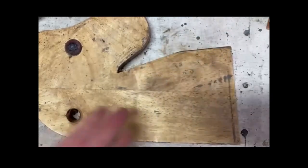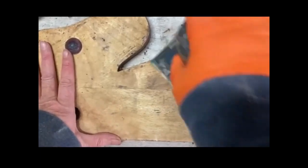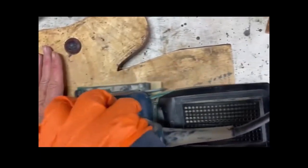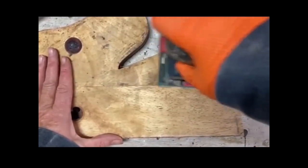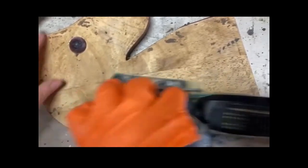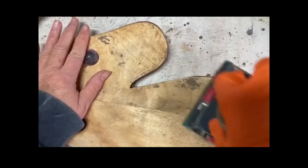There I am. I'm coming in now, and you'll see the actual technical term, gunk, built up by the neck. It's not stain, it's not wood, it's residue from the stripper. Citrus strip, I find, does this even more so for me. I found that mineral spirits does a really good job of getting rid of it. You're going to see me point out the big part of it where it builds up right here. See it building there?